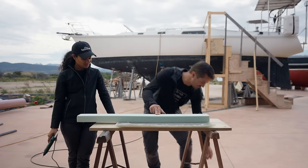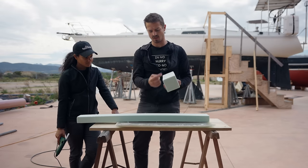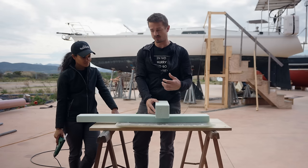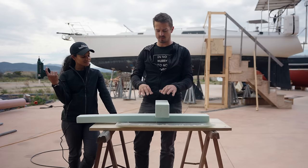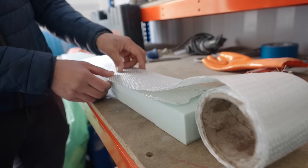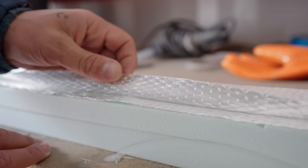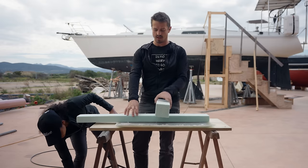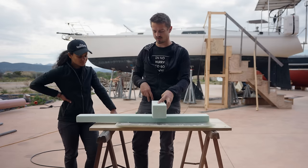And then once that is glassed down, we're gonna take this 100 by 100 mil, which is more the stringer, cut a notch out and glass that one, which is representational of the stringer that goes along horizontally through the boat. The idea behind doing them overlapping this way is we're doing layers of uni, so like unilateral fibers, so they're not like biaxial or woven roving, so they're super strong in one direction, but those are gonna go down along the front edge of the rib, and then when we put the stringer over top of it, it's gonna go along the inside edge of the stringer.